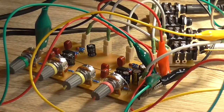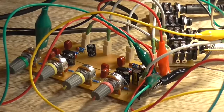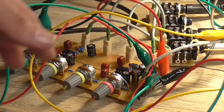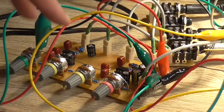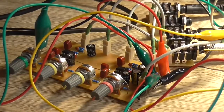So I'm pretty sure I've got my values worked out correctly for the gain structures for each type of device. So I'm going to rewrite the table up properly and then append it to the finished schematic, which will be available in the last part of this series when we actually look at the output section on PCB. So that's what this is ready for next. But there's a lot less noise now being picked up, especially on the guitar inputs, because everything's using shielded cable and we're using a PCB which has been routed correctly with ground planes in mind.